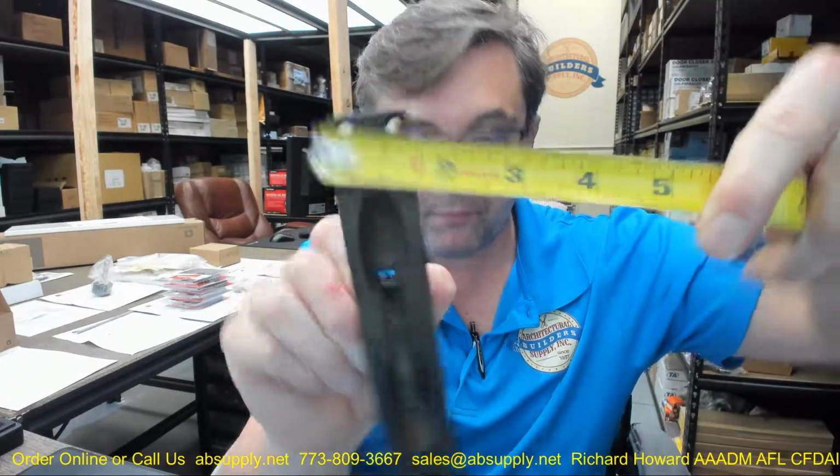This is a far less common flush bolt in the modern era than it was 2, 3, maybe 4 decades ago. And what the 550 is, that's different than the 555. The only difference really is that it is 1 1/4 wide. So very commonly you're going to see 1 1/4 wide manual lever extension flush bolts installed in hollow metal doors. That's the only difference that I can ascertain between this and the 555. 1 1/4 wide, 6 3/4 tall.